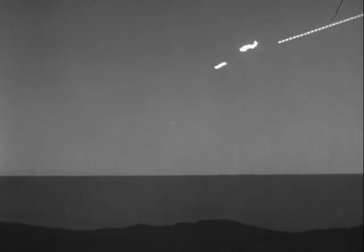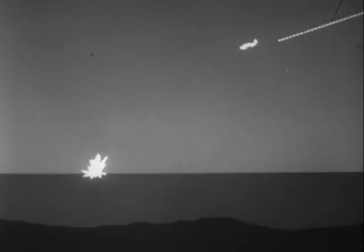not only is there the danger of the torpedo hitting bottom because of the initial deep dive, but the torpedo may stub its toe, which may cause structural damage or damage the steering mechanism, causing premature sinking or a very erratic run.